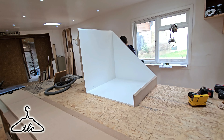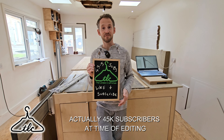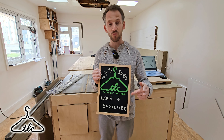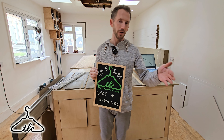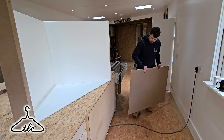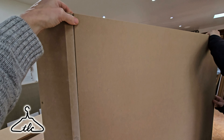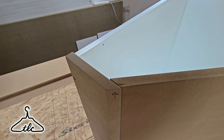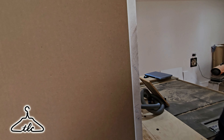Just using 30 mils and pre-drilling the length of a 30 mil screw with a 3 mil drill bit. Come about 100 mil up, putting loads of screws in here — pre-drill with the 3 mil, pump that screw in. There we go. We've got the backing done with enough screws in there. Don't skimp on the screws, they don't cost a lot of money. Now let's go around the other side and show you the front. We're going to tip it back to get this angle top on.